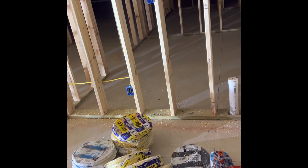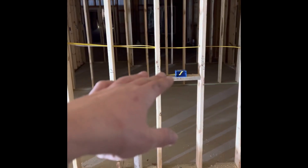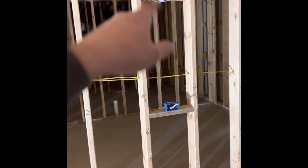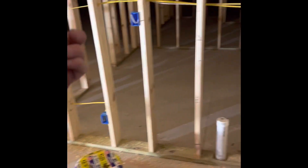I was reading today that it used to be you could share that 20-amp circuit vanity outlets with other bathrooms, but they changed it to where it has to be dedicated. So if you want outlets above a vanity counter, it has to be a dedicated 20-amp circuit. I did a switch here for that vanity outlet — that way, if you wanted to leave the main lights off and only flip that one on, it could be too much to have all these lights going.